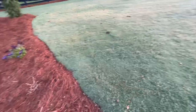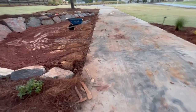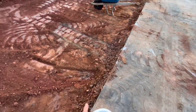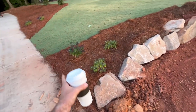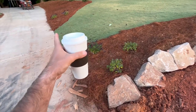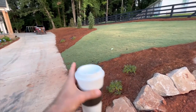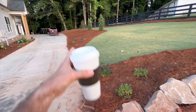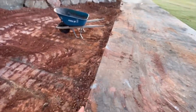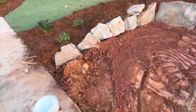and just sort of dump it out over there, so that we've got some drainage in this area here. So I don't have to dig this trench very deep, probably just another 3 inches or so, from where it's already at here. And then that area, we'll have to dig that out. Fortunately, a lot of this dirt right here is all kind of fill dirt. So it's a little bit easier digging. So we'll just dig it out down there until I check the pitch, and once I feel like I've got adequate pitch and I'm above the ground, I'll stop it and just let it drain off down the driveway. So we'll have some drainage through here. So any water that might come through here, migrate through this gravel, will hit that drain. It'll run that way before it goes up over the driveway.